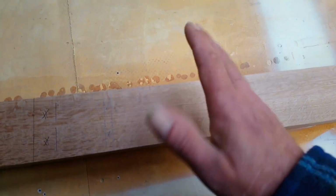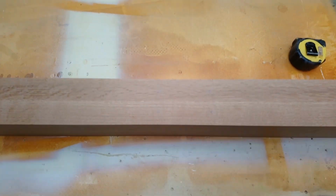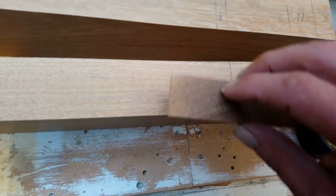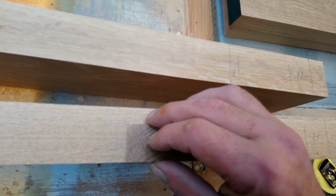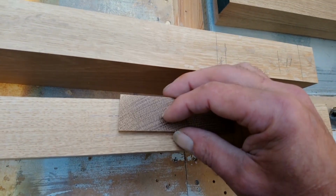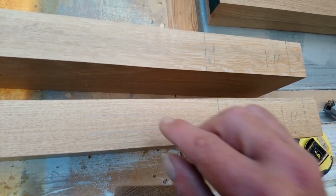Top same as bottom. It's almost reversible this door. This will be in the centre. Just got to get the braces the right way around. I don't know if you can see, there's some pencil marks on there. This is a piece of the rail. And when it's on like that, it leaves 15mm for the boards. If I offset that, be 15mm there again.